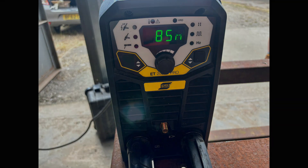On today's video we're going to be completing a butt weld using the TIG welding process using 185 amps on 6mm plate using a single V prep. We're going to be showing you the tips on how to complete this from start to finish, starting with your root run all the way to your final capping pass.